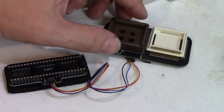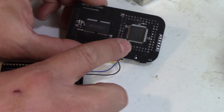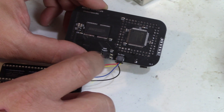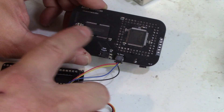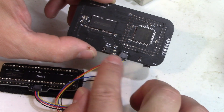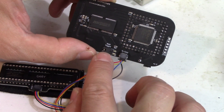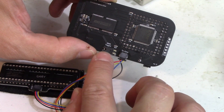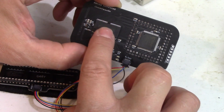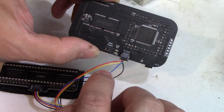Here's the handsome little board right here — this is the actual Ramses board. On this side you see we have some logic chips and some little brain chips that are so hard to find nowadays, which is why these aren't always readily available. Here we've got 2 megabytes of the actual chip RAM right there. We've got some jumpers — this one is a RAM toggle jumper that will toggle it between 2 megabytes of chip RAM or 1 megabyte of chip RAM and 512 kilobytes of slow fast RAM for compatibility with some older games.